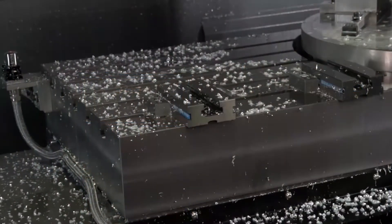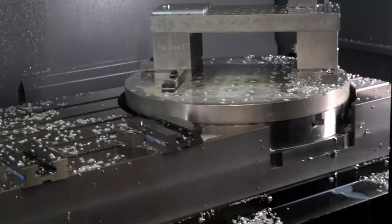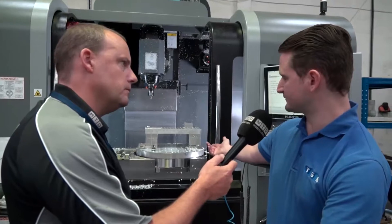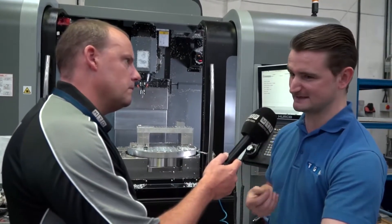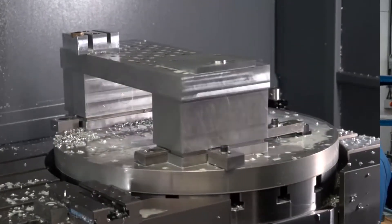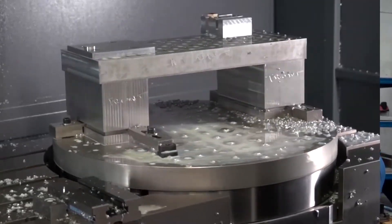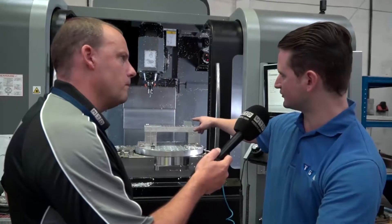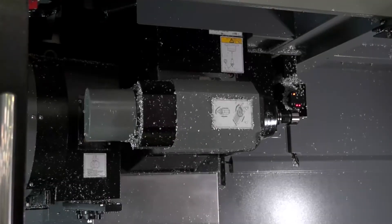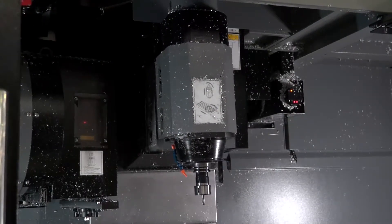This table in here — this is the C-axis, correct? Yes. You've got a fixture plate on top of there — is that just to give you extra height on your component? That's a matrix plate so that we can locate the parts in a specific place every time, so it's good for repeatability and set-up times. You need the height to raise it up, and then you need your pillars to raise it up because of the head — when it goes over at 90 degrees it needs space to get to the job without fouling on the table.